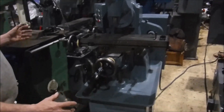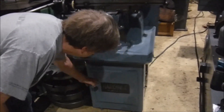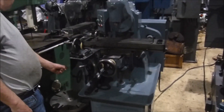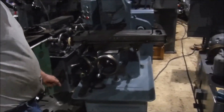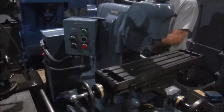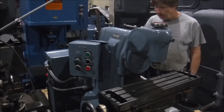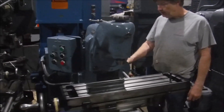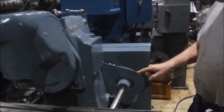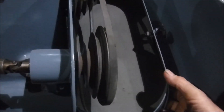That's basically it. There's a storage area. You change the speeds down there by the step pulley. There's a cover back here — it's wired 440 volts. And you got a cover back here to change the feeds. You got four feeds right there, cover right there for that.